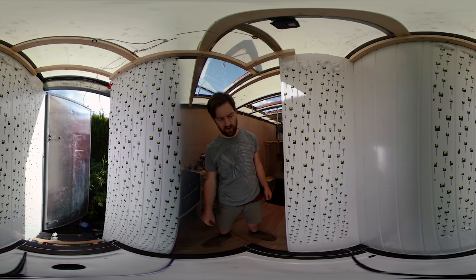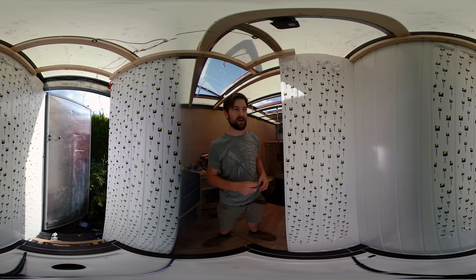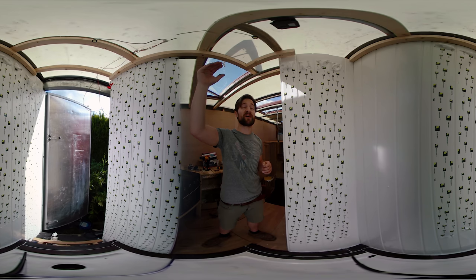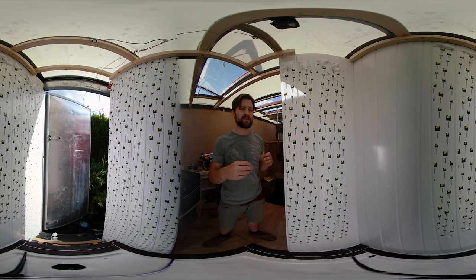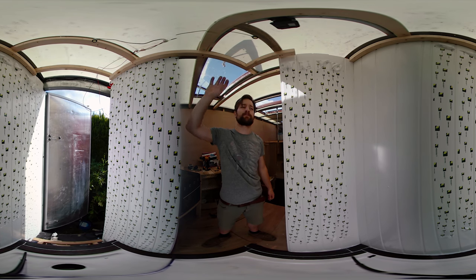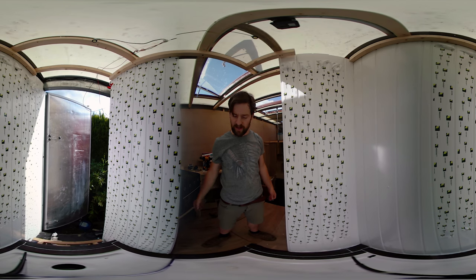There's somewhere I've actually gone wrong and I'm going to have to plug the holes in the plastic, because the point of the plastic and the roofing is to make it watertight — or moisture-proof — so that moisture doesn't get through to the ceiling and instead goes through the extractor fan.